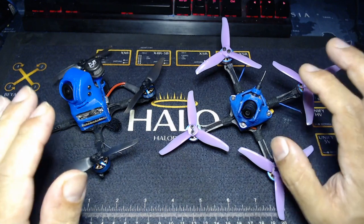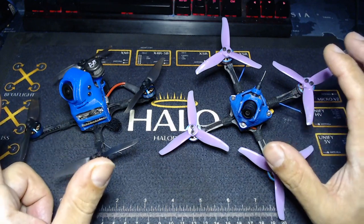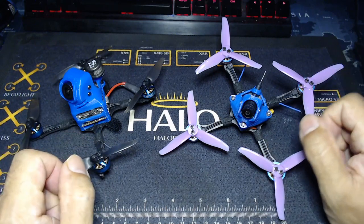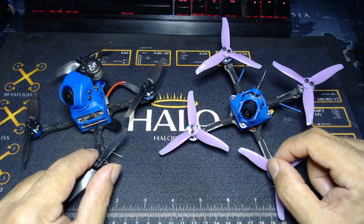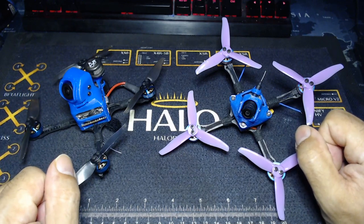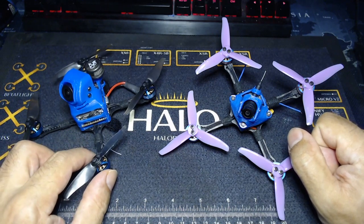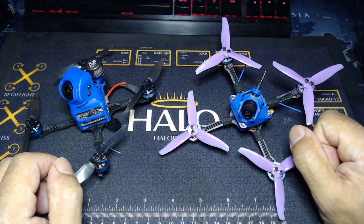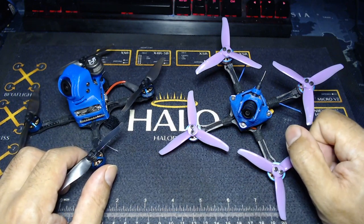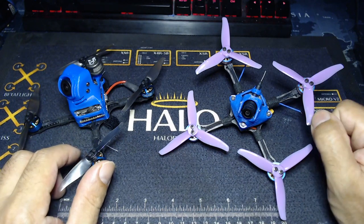We've certainly had some great feedback. In terms of how things have developed, I tend to be flying mine pretty much exclusively. Most of these miniature flight controllers are on DSHOT 600 at the fastest. What I tend to do is use JESC — I do pay the few bucks per each guitar pick — and then I run on the latest JESC. I do run at 24 kilohertz. I find the 48 to be a little bit twitchy; I think that works well for the ducted prop stuff, but it's just a little bit too twitchy on the three-inch guitar picks. I found 24 to be really very smooth, everything feels great, no complaints at all and they tune up so well.